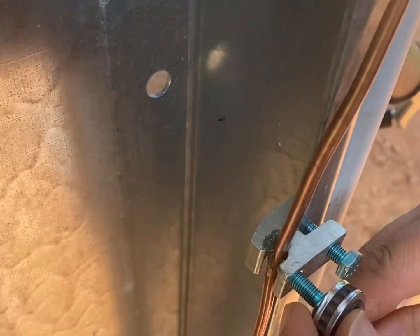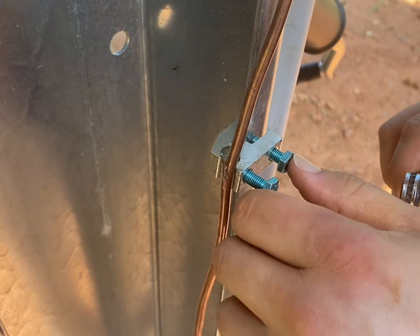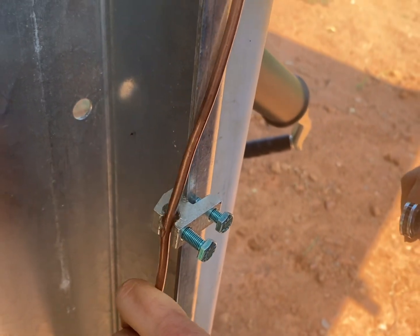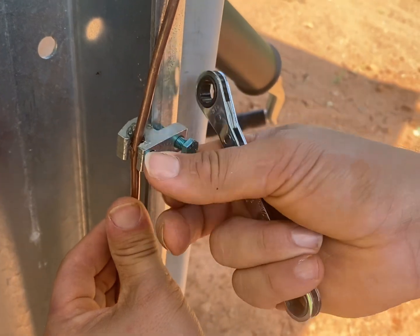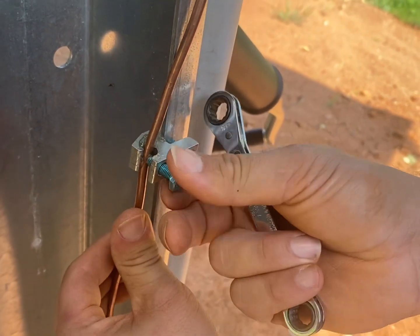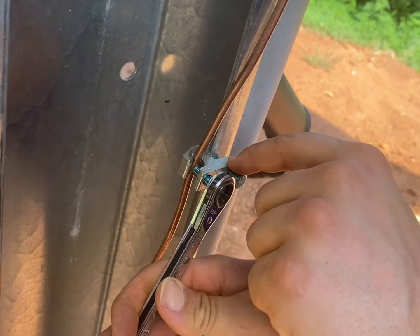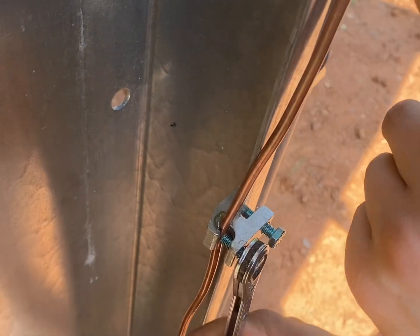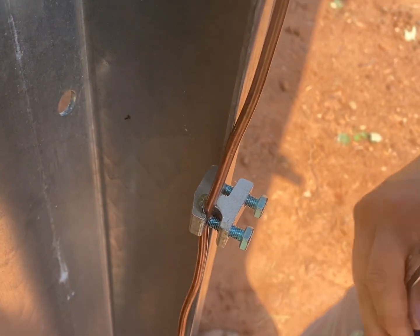I think this is just the perfect little piece to attach the ground wire to the C-channel on this rail. I could easily extend this ground wire all the way down to a ground rod — I haven't driven a ground rod on this system, but I could. They don't want you to use smaller than a piece of number six bare when it's run exposed like this because they consider it subject to damage. Now this little lug has bonded my piece of ground wire to this, and I'm also bonded inside the junction box.